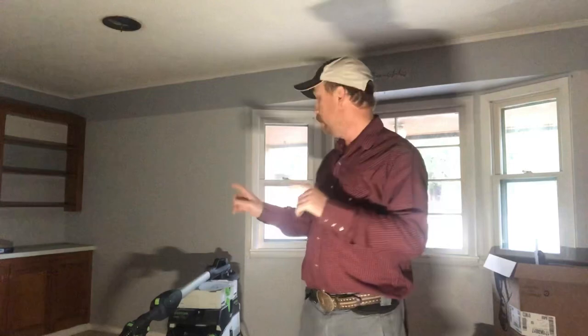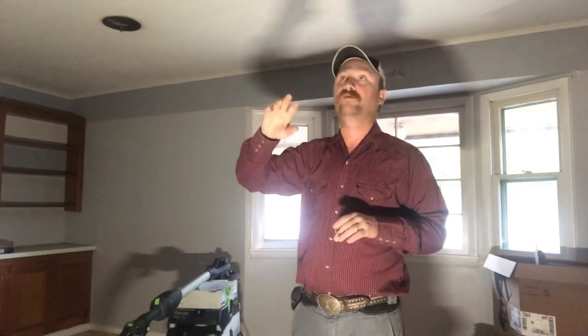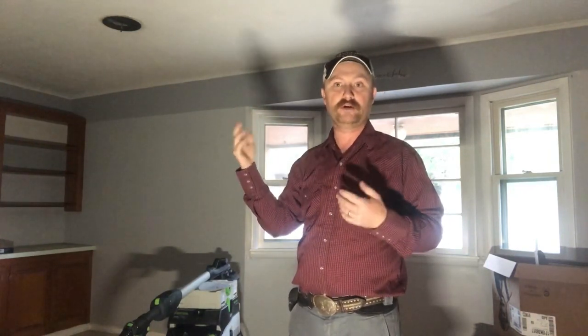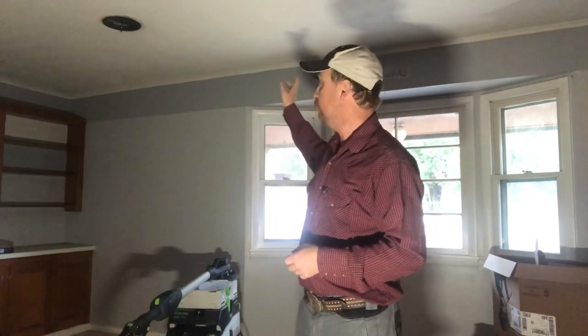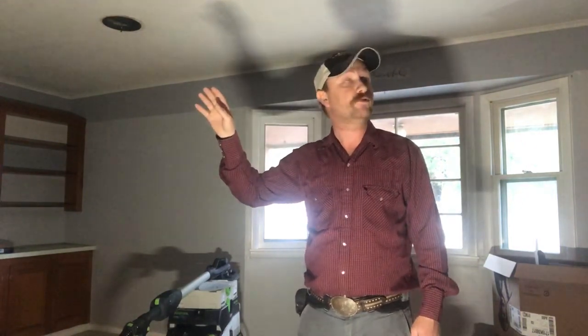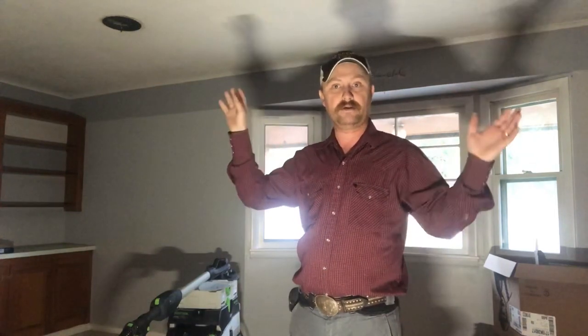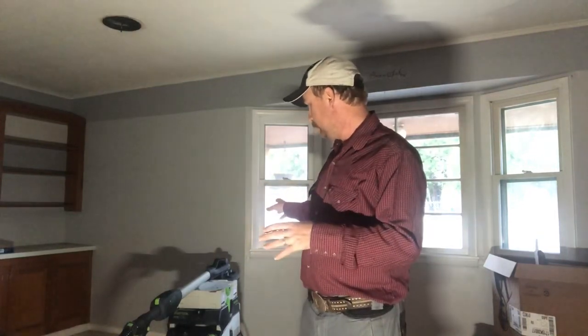I'm running 40-grit Granat to start — it eats the popcorn straight off. If you're not taking it all the way to smooth, that may be all I need to do. I'll do a 120 pass back over it tomorrow and see how it comes out, but the way it looks right now I think it's paint ready. They even shot the texture on the cove molding around the ceiling. It's about an inch and a half to two inch cove; we're going back with a big crown to cover it up, so that's fine.